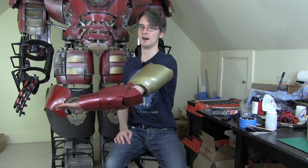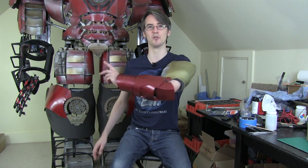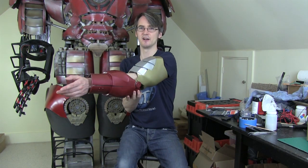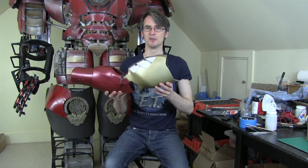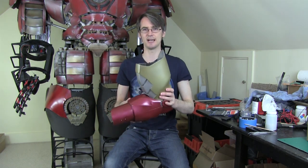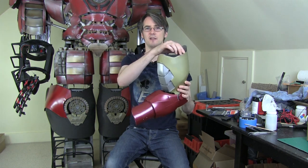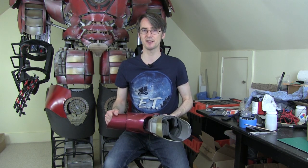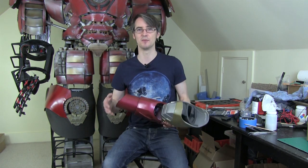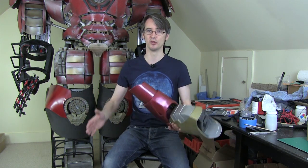The initial problem was: when you've got your Iron Man arm, how do you get your arms on? They're generally the piece you can't suit up by yourself, because when one arm is on, it's really hard to reach the other shoulder to undo a buckle. In mine, I did a clever opening mechanism so the thing grips your arm, but it slips down over several hours of wear. Last time we looked at 3D printed latches you could activate — perhaps cable driven from the cuff with one hand — or a hook. Obviously when you move your arm up the hook could come off, so it really needs to be a latch. The eventual aim was to have a whole locking flexible exoskeleton covering your entire body, dealing with all joints and locking.